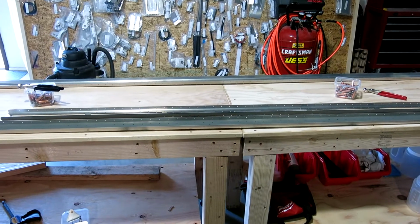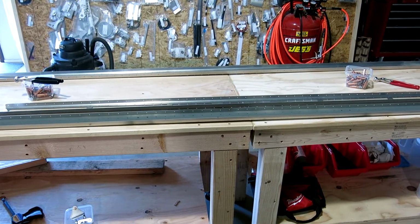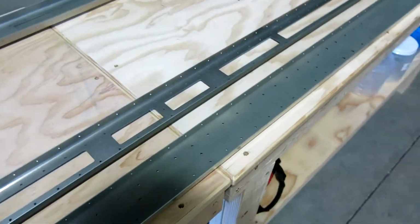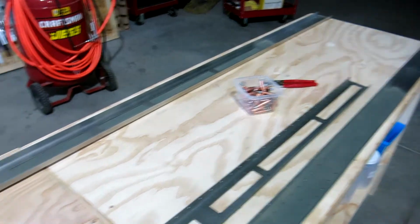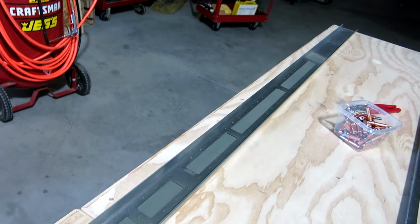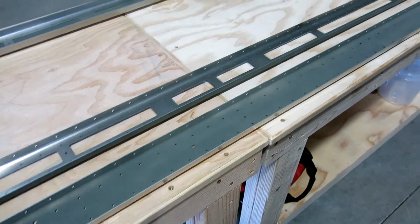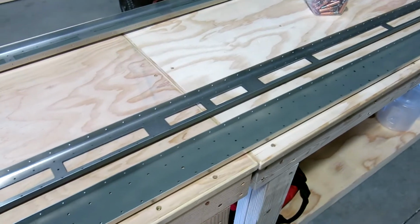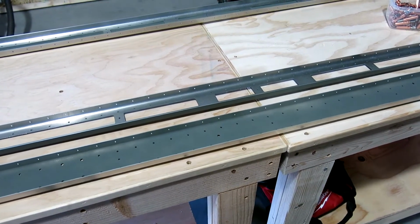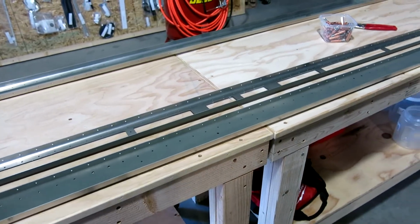So we're gonna start on the horizontal stabilizer, and we're just starting on the frame, and there's a doubler that goes into each of the spars. This one already has. We just laid it in there for right now before we do any clecoing or riveting, but those will go in there, and we'll rivet all the ribs and the nose ribs and the hinges in. So we'll be back.